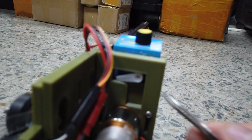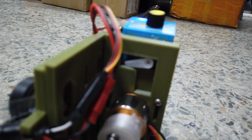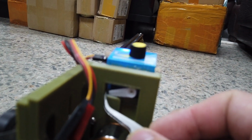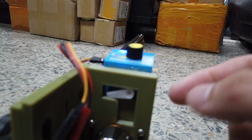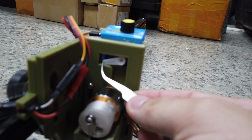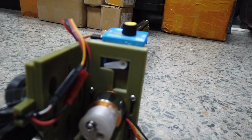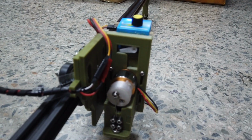Okay, and by the way, you have to cut the servo horn here shorter as well, otherwise it will travel too high up and then may create binding. So you can fine tune there. This is about the length of the servo horn I have cut at the front with 6 holes remaining. If you cut it too short, then the travel will be lesser. So if there's any binding, you start by trimming off the front part of the servo horn a little bit, then try M3 S90 and M5 again until there's no binding. Once you're satisfied, you can install the screw, but I have run this many times without a screw as well and it never pops up.